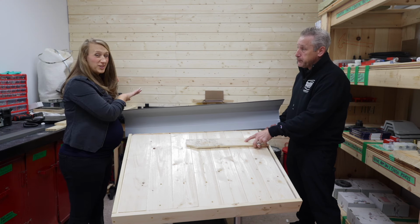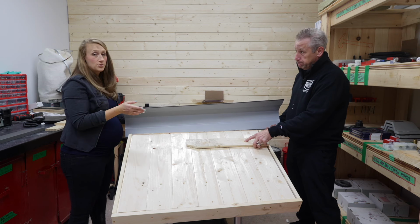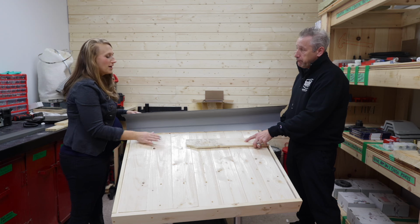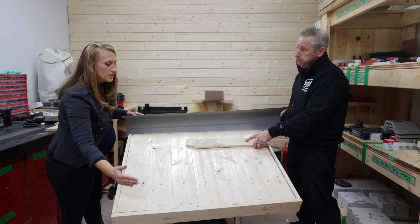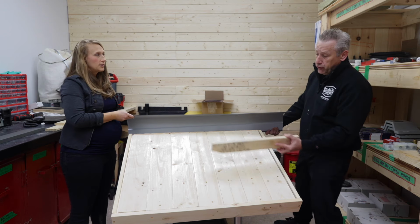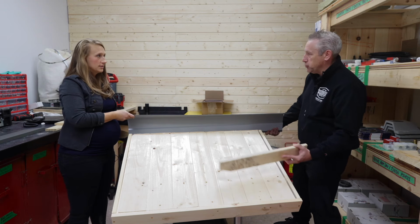So we do our perimeter. We're going to make sure that we check our ridge cap, because obviously if yours is slightly different, you want to still make sure it's going to work with your ridge cap for that top piece. And then, did you say it was roughly every 2 feet? We want 2 foot on center typically. Okay. Because you may have a 9-foot run, then you just space it evenly between there. Okay, cool.